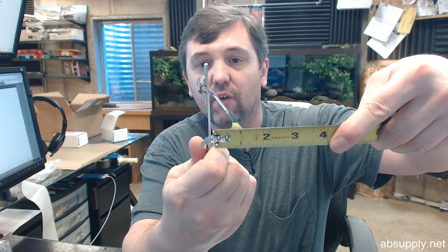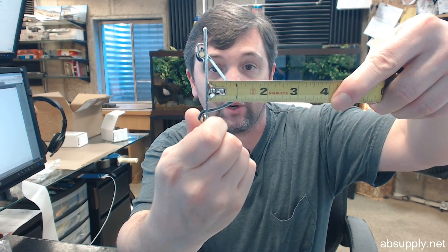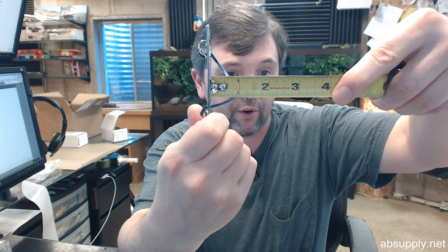After, of course, you've determined the height at which to install that, you might want to take an audit of the balance of the doors in the space to make sure that while the edge doesn't matter so much, but if you have a line of sight down a long hallway in a commercial application, you want the lock height to be a correct line of sight all the way down. So you might want to review where to prep for the face pulls, the flush pulls, and then, of course, you're going to want your edge pull to be very much in the vicinity of those. Another dimension that I've been asked in the past is how far it projects when pulled out. So from the face of the edge of the door down to the extreme part of the pull, you're at 1.25 inches. Okay.